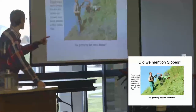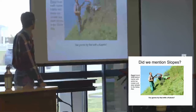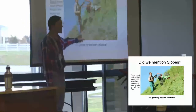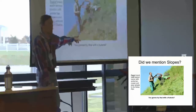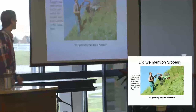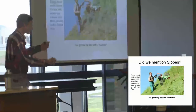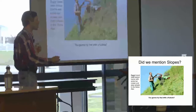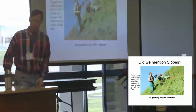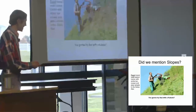The true old Gravelys would handle slopes like that, like the real gear drive ones made in West Virginia. But this guy has cleated combat boots on, okay? You don't stand on a slope like that without them. I've been in the Italian Alps watching people mow on these kinds of slopes. It's freaking scary. The guy's wearing cleats, and you only turn the tractor going uphill. You make your turns uphill, because if you turn going downhill, it's hard to get down the slope. It's quite a little chore.